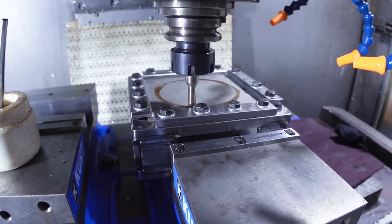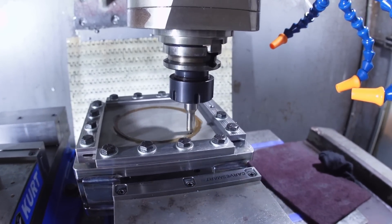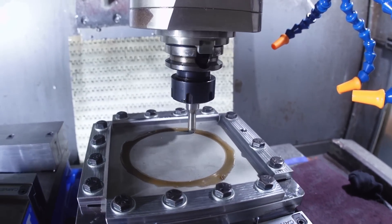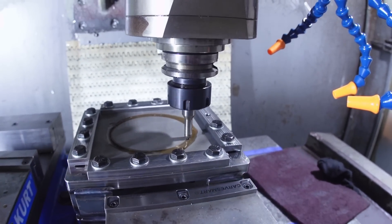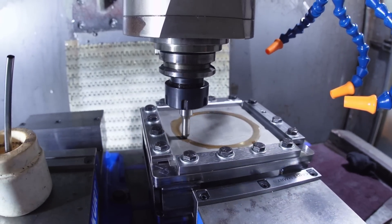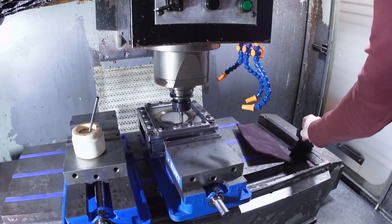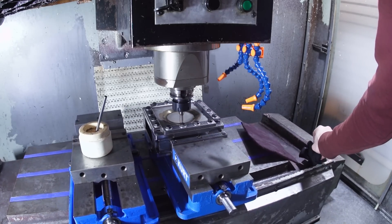The cone that I just did successfully in stainless, I'm trying in titanium. I've got the spindle turning at 20 RPM — I feel like that's kind of arbitrary, I'm just turning it so that the bearings aren't stationary. The forming feed rate is 80 inches a minute. I tried 100 inches a minute once, seemed a little fast. I tried 30 inches a minute, seemed a little slow. I'm liking 80. It's a bit of galling — the surface finish isn't great, I could maybe be using a better lubricant.